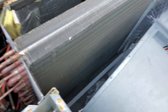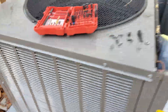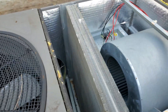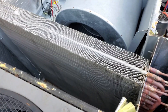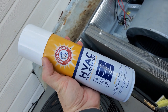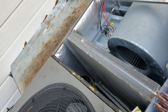This is the evaporator coil, not to be confused with the condenser coils, which is right here. Earlier I had cleaned the condenser coil with a sulfuric acid cleaner designed for such, but sulfuric acid is definitely not recommended for these evaporator coils. So I'll be using this product here that I purchased at Lowe's — it also has great reviews on Amazon, but it's cheaper at Lowe's.